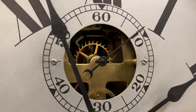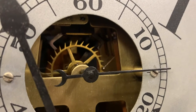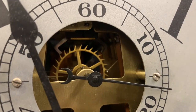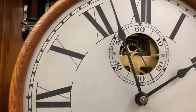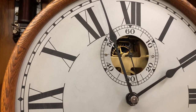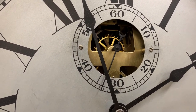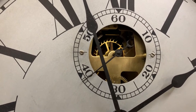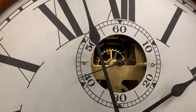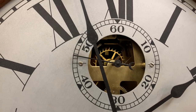If you look right about 1 o'clock behind the escape wheel, you can see an arm going around. That is an electrical contact that does some functions — one of those is advancing this tape mechanism, and it also winds the clock at the same time. There's also a contact in front of the escape wheel at about 10:30 or 11 o'clock that drives the slave clocks. It's an ingenious design using the escape wheel, which goes around once a minute, to do various tasks.